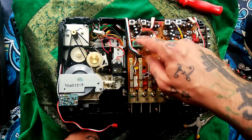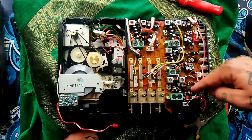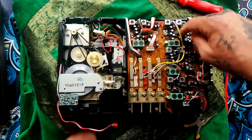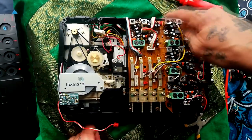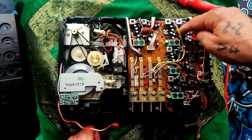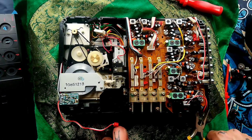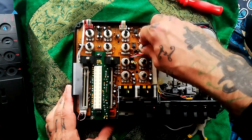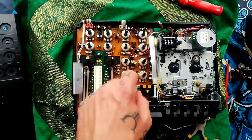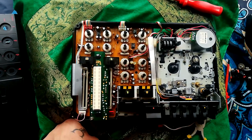components come in groups. So these are going to be associated with, you see these long integrated circuits, they've got a Dolby system on it, so this has got Dolby noise reduction. So that'll be setting up the timing for the compander. I'm not sure there's much else to say about that board. Over here you can see all these op amps, one per channel, so I guess that'll be the input gain for the four channels. I'm not actually sure what those two trimpots are.